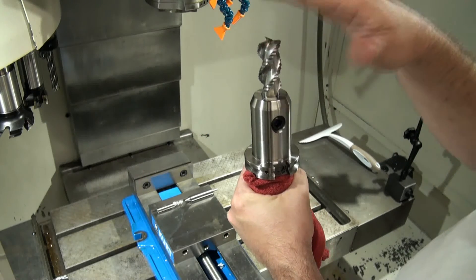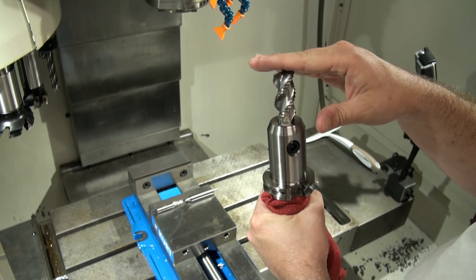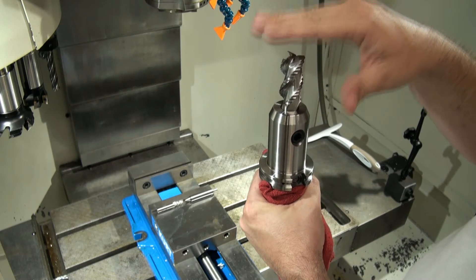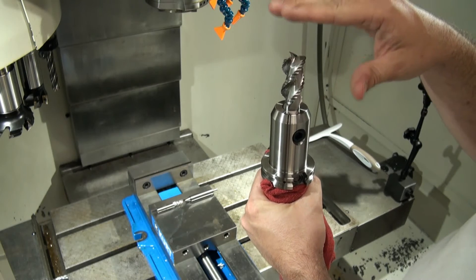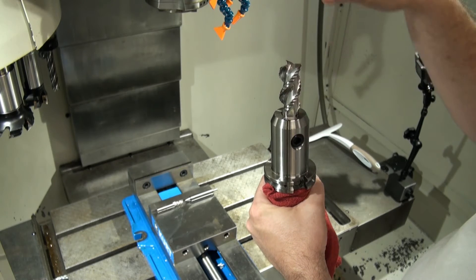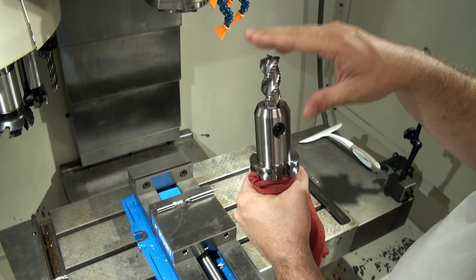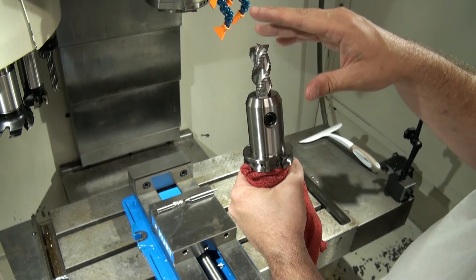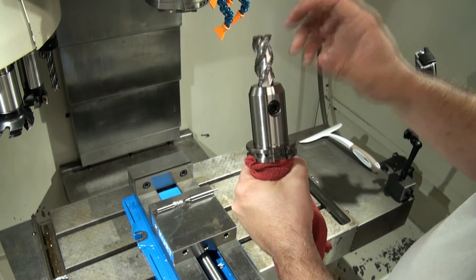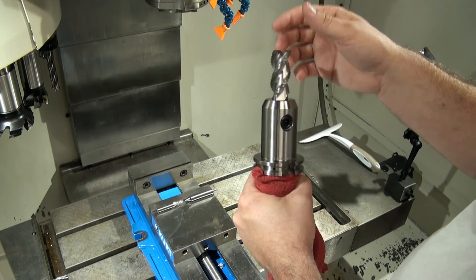You're doing it at a workstation ahead of time, so your machine can still be making chips while you're setting new tools. And two, because we're using an external reference, that reference is going to be identical for every tool, and then we can move that tool to every machine in our shop. That gives us great flexibility of being able to set a tool length for this tool, write it down, remember it, and have the flexibility to move that tool to any machine.